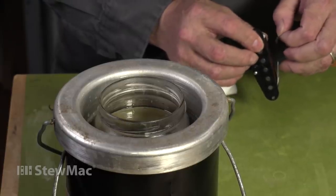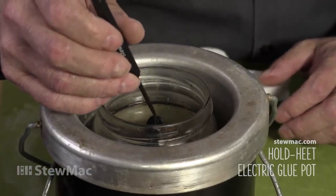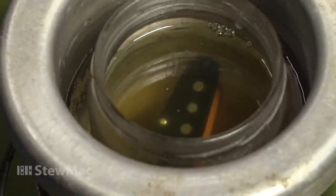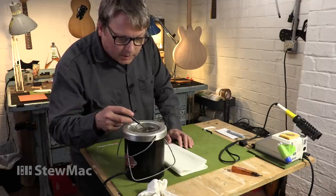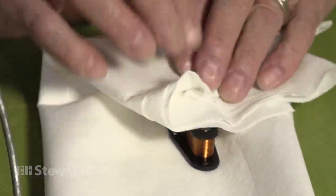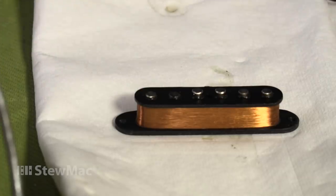I'm going to install this. I've peeled the little safety belt off. Remember, this pickup was wax potted, so we are going to wax pot it again, just like it was when it left the factory. I'm going to dunk it in this beeswax here. You just want to wait until there are no more air bubbles coming up out of the coil — you can see the bubbles right there. We're going to let it sit until the wax is thoroughly soaked in and I'm not seeing an abundance of air coming up. Looks like it's stopped bubbling after about four and a half minutes. I'm going to pull it out, let it drain a little bit, set it on a paper towel and gently pat it down to soak up the excess wax. I don't touch the coil wire. There's our waxed coil ready to be installed.